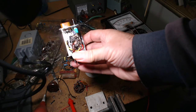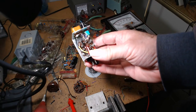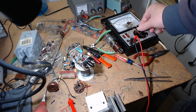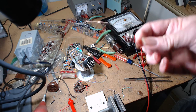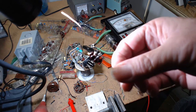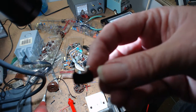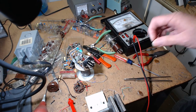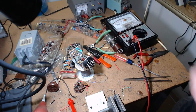Every day I add a few wires and I double and triple check everything. What's happening now is I'm having to add capacitors in parallel — sometimes three. This is a hundred picofarad at probably 600 volts, using what I've got. I have two bigger ones — two 53s in parallel — which will be in the area of the plate.